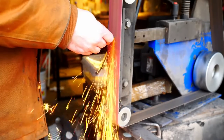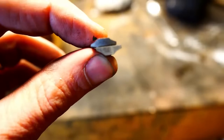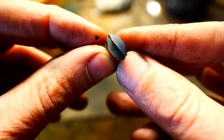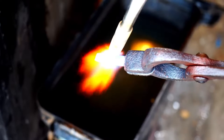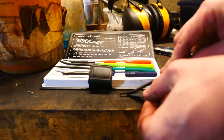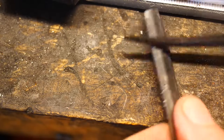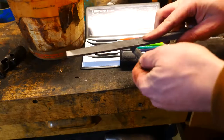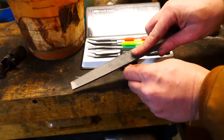You can see there may be a few more sparks with the carburized version — it's sort of hard to tell. I'm going to put it in the etchant and we'll see. The top one is our carburized piece; maybe it's a little darker, indicating more carbon. I think the best thing to do is just go ahead and quench it and see if it can harden up. It would be much more usable if the HRC was closer to 60. It's actually skating the 65 HRC file, and a regular file — usually about 63 to 65 HRC — and it skates that too, so we're in good shape.